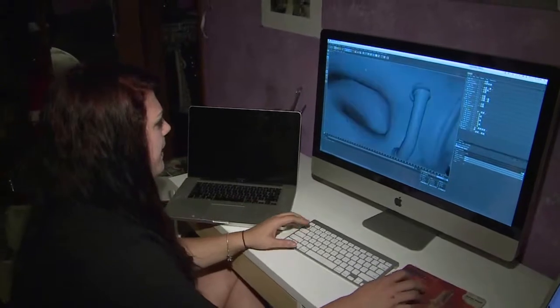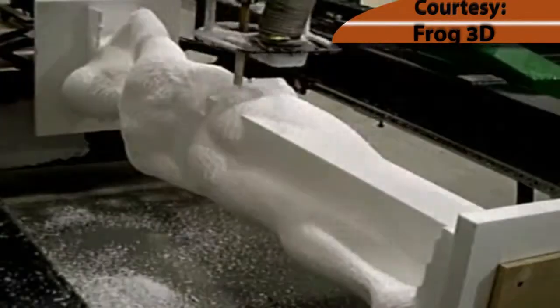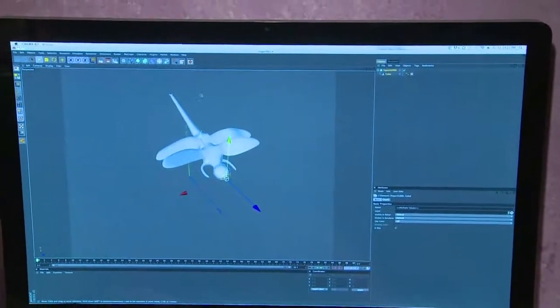I've done a lot of stuff on the CNC machine. It's a big machine with a drill bit — you program a path for it to follow. It goes back and forth and can work in styrofoam, wood, or metal depending on the machine. The one at school we primarily use styrofoam. You make a path for it and it carves out the shape, going over and down in layers, and all of a sudden out of this big block of styrofoam you have your piece. Learning how to use the machine is finicky — my professor is the one who built ours, so there's no instruction manual. Over the course of a semester you can go from not knowing how to open the program to being able to make and print something.